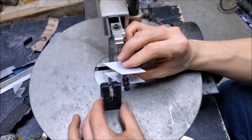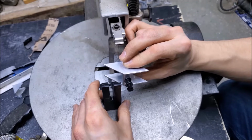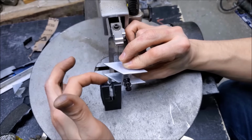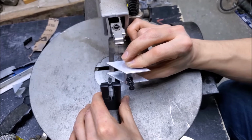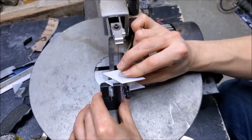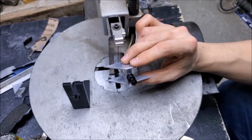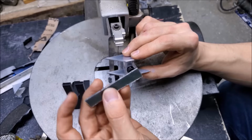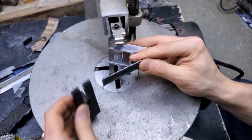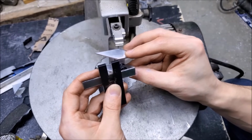I want to be able to make a couple of adjustments. I have this cut out right here, which will allow me to do any vertical adjustment, but I want to cut out on the bracket that'll join this and this together to give me a horizontal motion so I can translate the beam wherever I need to. So I'm going to make something that's, say, like this. Going to have a little hole here, and then I'll be able to do this with it. So a little bit of a piece to make.